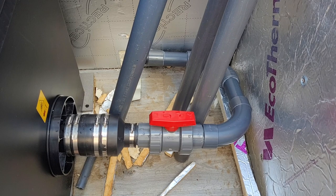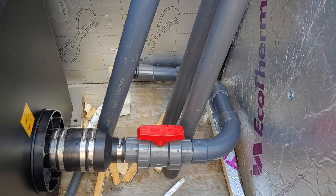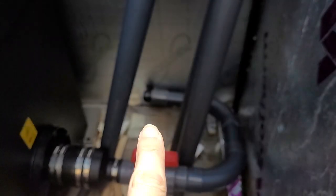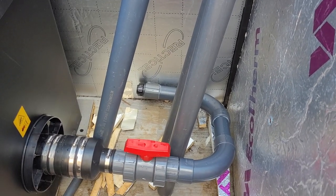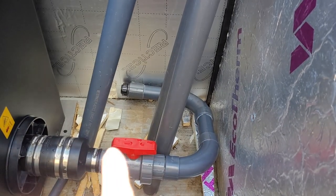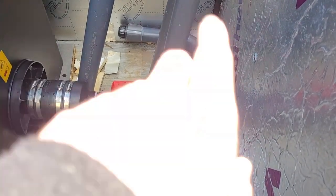So this is as far as I've got so far. That connects into the pump — it's all glued up and the pump does fit down there. It's sitting a bit wonky at the minute because it's only supported by the rubber boot. I didn't want to go 90 down, 90 over, then 90 that way — that's three 90s — so I've just sloped it down, meaning I've only got two 90s. It does mean if I need to get to the back wall I have to step over it, but it's only about a foot and a half off the ground, so that's no problem.